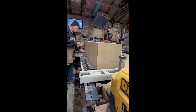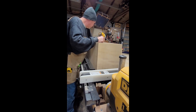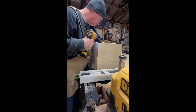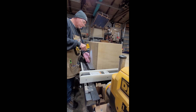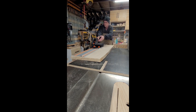This unit ends up being about 80 inches tall, which is a pretty good size. Unless you're really looking for those plugs you probably won't see them. It was a little difficult getting in there, but at some point I had to switch over to the small Kreg bit so that I could get the drill inside and get all those pocket holes screwed in. What I realized was I forgot to add some pocket holes on that one side, so I put the glue on there and just used some clamps to clamp it down.